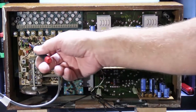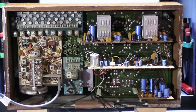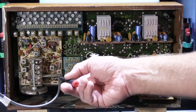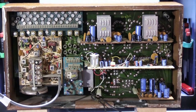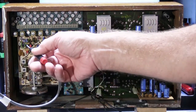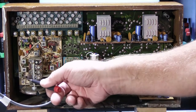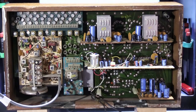Over here we have the AM/FM tuner assembly. This is the same type of tuner assembly that's used in other 70s models. The primary difference with this is a stereo tuner module. A standard tuner module is monaural for AM and FM because other systems are monaural systems, but this is a stereo tuner because it's a stereo intercom. While the components for mono or stereo are actually on all of the tuner assemblies NuTone made at this time, the stereo ones have this little 3-pin connector over here, and that's how you get the stereo out.